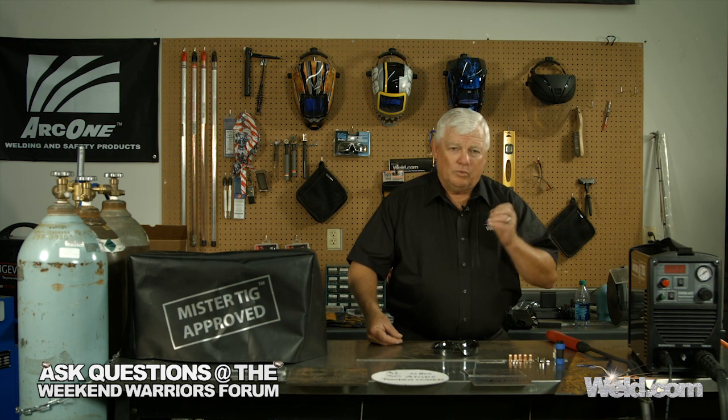It's so easy to set this machine at its maximum — this thing will go up to 50 amps. You can cut 3/4-inch steel at 50 amps. You can also cut sheet metal at 50 amps, but it'll wear out your tips quicker. So we're going to give you a good reference guide, and I'm going to go from sheet metal all the way up to half-inch aluminum. Something to keep in mind with aluminum: it absorbs a lot of energy — almost twice the amount. So you're going to see that the amperage has to be a lot higher. I've got half-inch thick aluminum here, and I'll be maxed out on it.